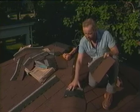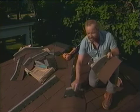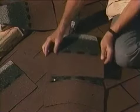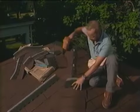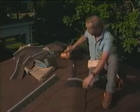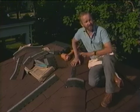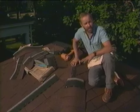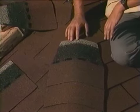And you apply the shingles one on top of the other one so that you will cover up the 2 nail heads that you put in the previous shingle, like this. Fold them evenly over, align it with a chalk line, and nail them in. Then when you've reached the ridge and completed that, that'll be the final step toward making your roof waterproof. And if you've done the installation properly, a roof like this should give you 25 to 30 years of life before it needs replacement.